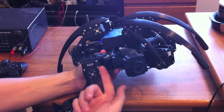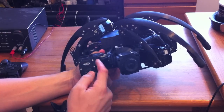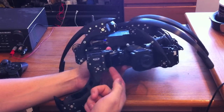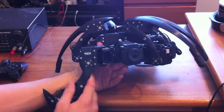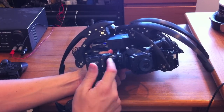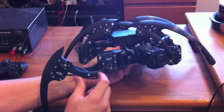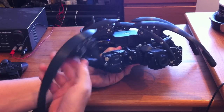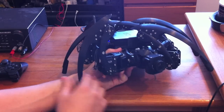The coxa, or the shoulder mechanism here, is identical to the other one except that it's a little bit beefier on the inside. It's hard to see because of the lighting and the black plastic. But this is the part that breaks the most often, so ideally this part should be made out of aluminum first. The next part that breaks is the femur. The tibias never break, but just to give an overall matching look, they should all be made out of aluminum.